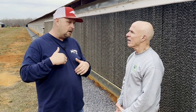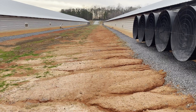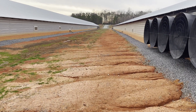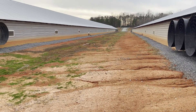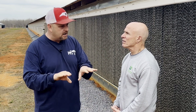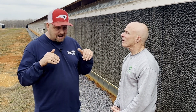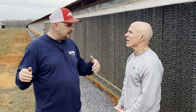Once I was available for the NRCS grant money to help with drip line erosion control, I built a little jig to help put this rock out, and hopefully this will control the erosion around the houses. Another reason is because if you have erosion problems, water can sometimes sink back in under the foundation and create challenges inside the house. I just wanted to avoid all that. So that's why I did what I did.